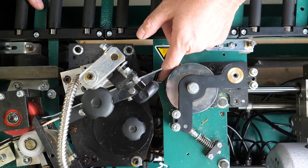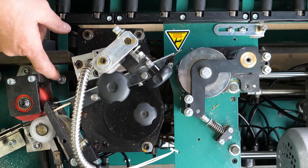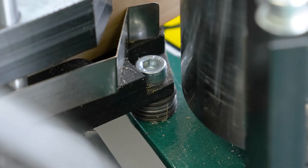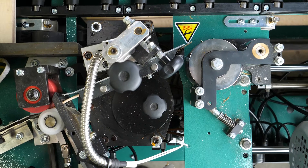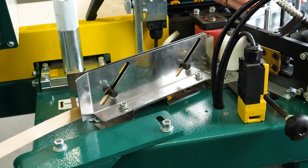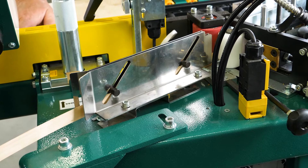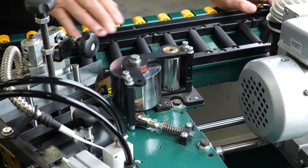This is the bolt on the aft side of the seat assembly, and this is the bolt on the forward side. Each of those has a set of washers used as shims underneath it. Whether you need to raise or lower the assembly, that means either adding more washers or removing washers that are currently there. Once the assembly is centered properly with the edge banding tape, you want to raise or lower it so the two match.